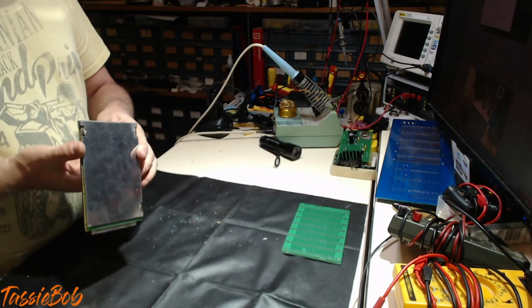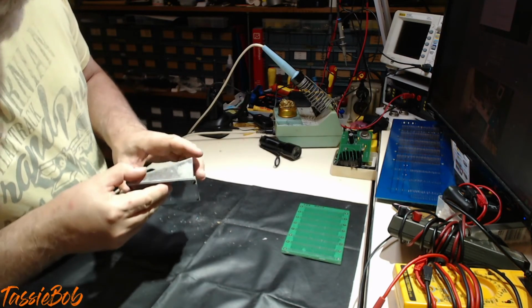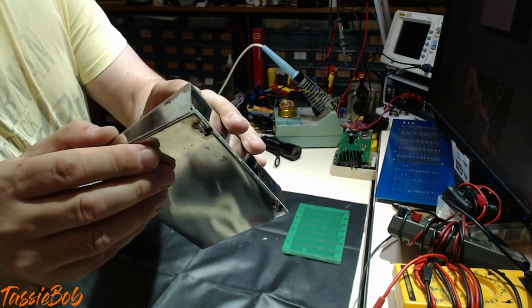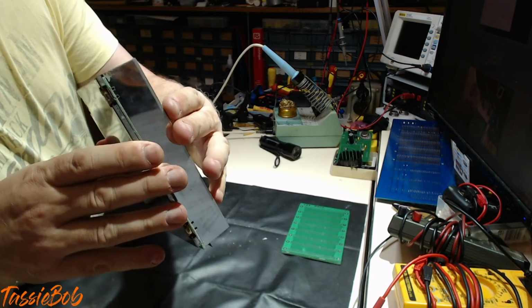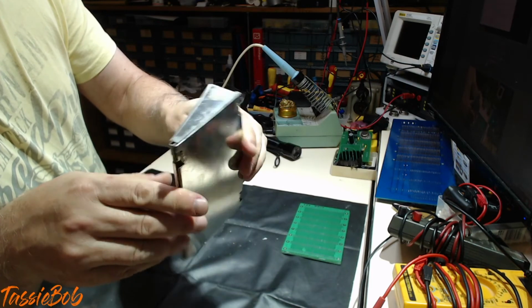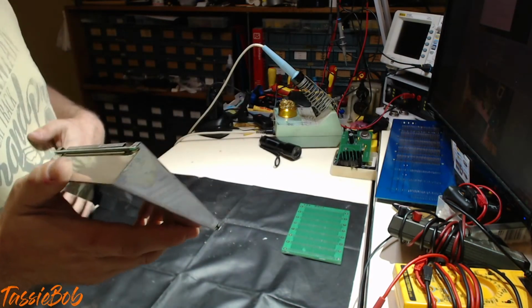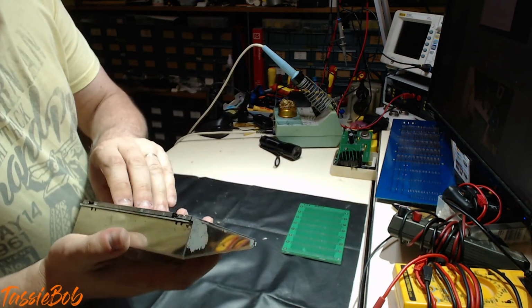Picked up an Amiga the other day, and the A501 has a bit of a splotch on the end there, and I'm thinking there's a battery in there, the real-time clock battery, that's probably leaked its guts. So once I get my soldering iron sorted, I'll rip the heat shield off that and have a look. The other soldering iron I've been using previously doesn't really have the thermal mass to get that undone.